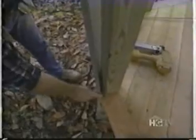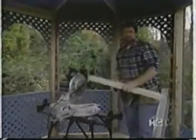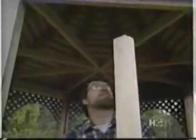Okay, now I put a little mark on the decking, which is a 1/2 inch beyond the post, which is the overlap that I want. So with that aligned, just nail it in place. Now this piece of 2x4 that I've notched each end on to fit around the corner board will just become a nailer for some other pieces of trim. Just secured with screws.